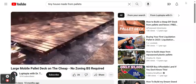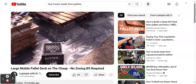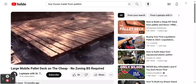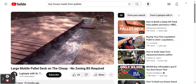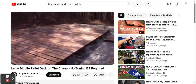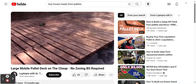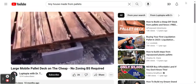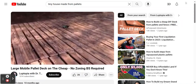This project took a little over two days with four of us working, so it was a long day. The first thing you have to do is put gravel down, then level bricks all the way across — and we did a lot of them. You can see there are many, many blocks. That's kind of our biggest expense besides the 200 dollars in pallets. We also put in about 50 bucks in screws and nails. Between the pallets we do scabs — we take a board and screw them to each one, with many scabs all the way down.